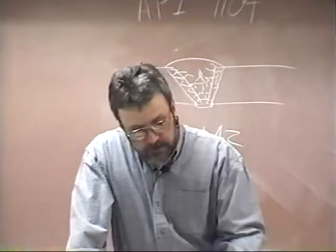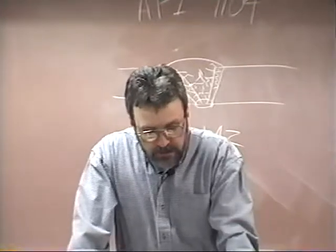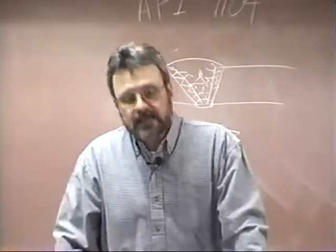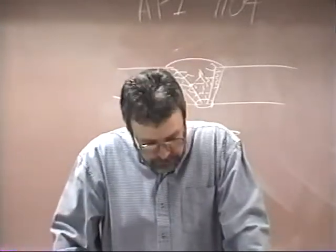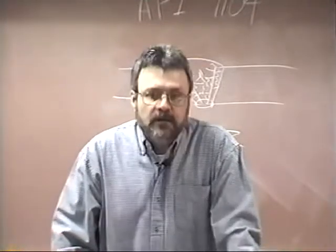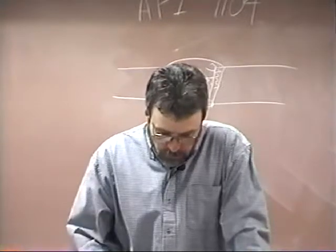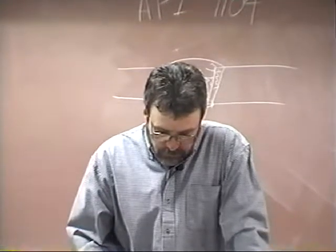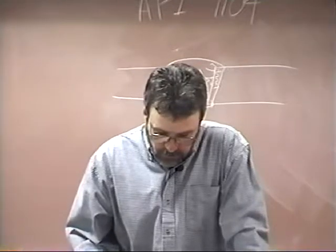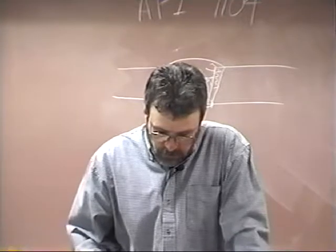Preparing the pipe joint, it says see figure 8.6. This is a standard joint specification for thin wall pipe. You'll note that we have a 1/16 inch land or root face and a 1/16 inch root opening with a 70 degree included bevel angle. Your joint fit up is extremely important. It's an essential variable. So you want to make sure that when you fit these up, you get it as accurate as you possibly can.